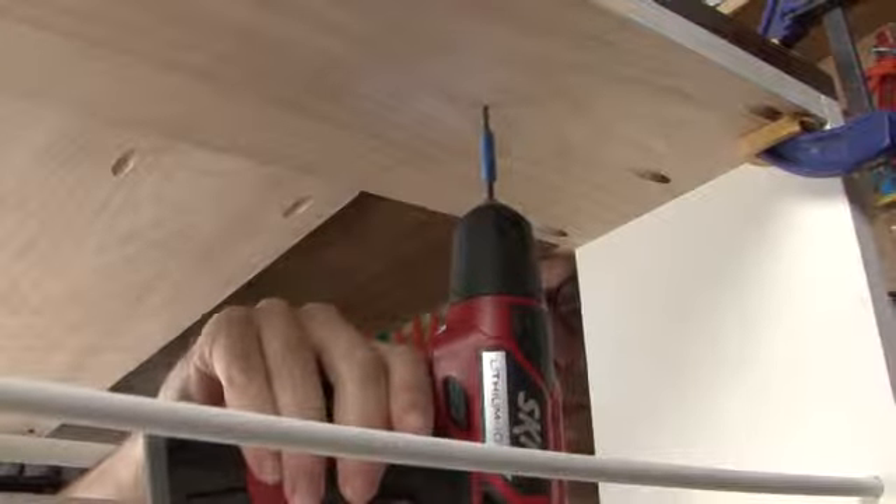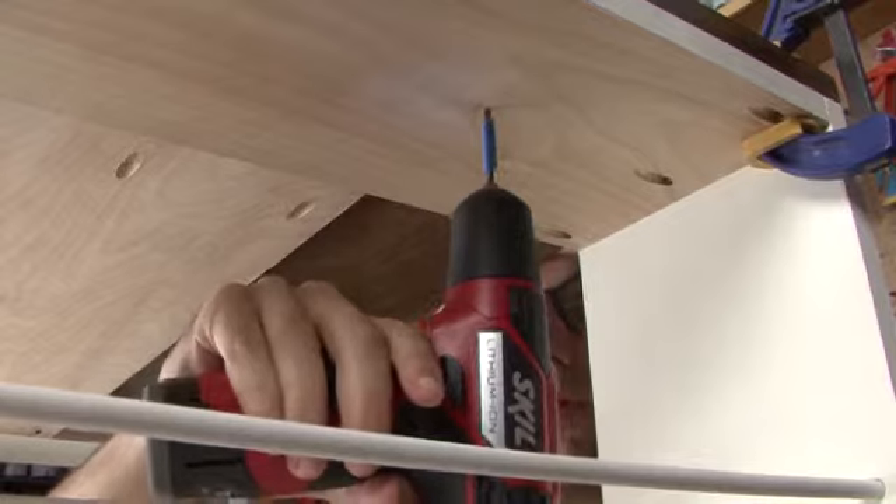If you're just doing rough framing or carpentry as opposed to finish work or fine woodworking, you can probably get through your project without pilot holes. But for the few seconds it takes, why risk ruining your beautiful wood? So by taking just a few extra seconds to drill a pilot hole, you can save time and a trip back to the hardware store.